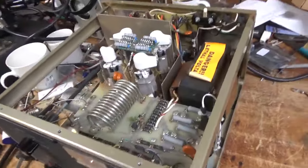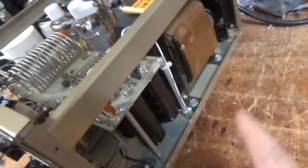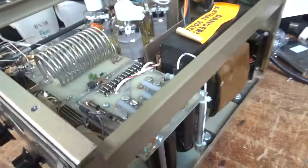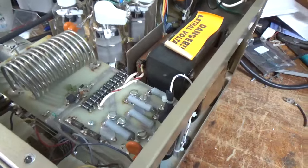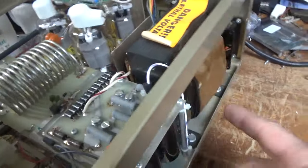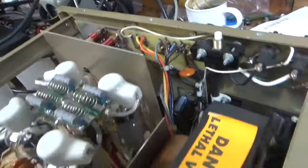I'm back with the completed AL-811H. Show you everything I did. Got new filter caps. Got new bleeder / equalization resistors. New meter protection diode. Did the bias modification. Added the diodes to the rear board. Got a new parasitic board from Tom.